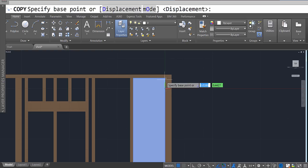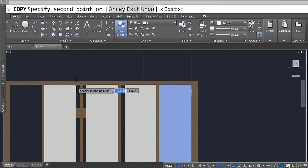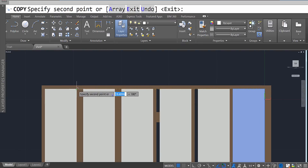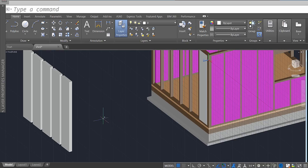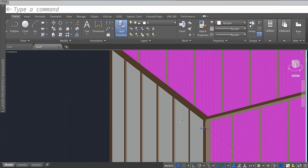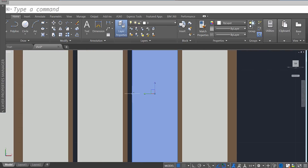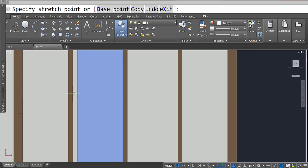Copy this, enter, and use the corner as a reference and put it in place. There's a small possibility you'll click on the front — that happens. If you rotate, you might notice it created out there — totally fine. Select them, use the move tool, and move that corner over to the corner it needs to fit in. That's looking good. Now it's just a matter of adjusting them such that they match the walls they're supposed to be going on.